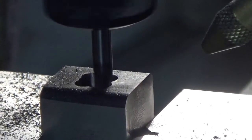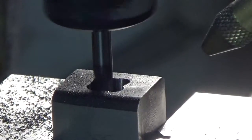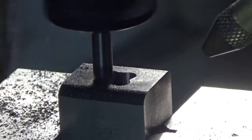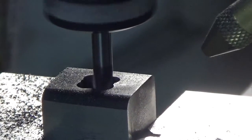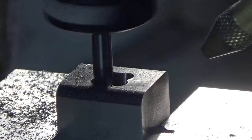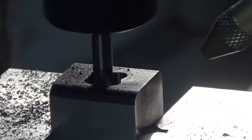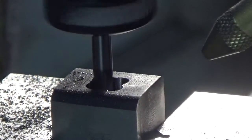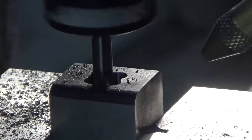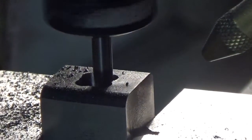I really like the square tool bit — I'm not keen on round ones. You have to fool around with round bits too much; once you square one, it goes back in the same every time except for height, so it's really the best way to go. Some old hand shapers just have round tool bits, but we have the CNC. An eighth-inch tool bit would probably work just fine — I used the three-sixteenth-inch end mill before when I made the pocket for the hole in the top of the ram on the shaper.